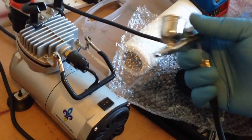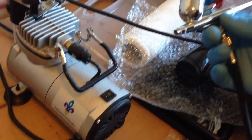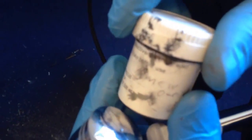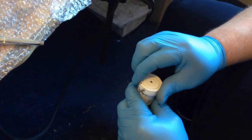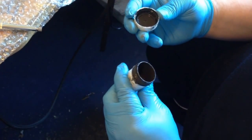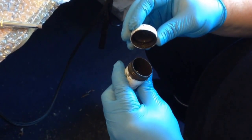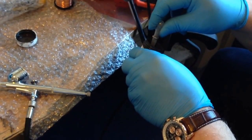The third step: we are using a simple airbrush and compressor to spray on the conductive ink. You can purchase a similar kit from Spa Plating. You can also apply the ink by paint brushing it on the item. In this case, we are using high grade conductive ink, also from Spa Plating.